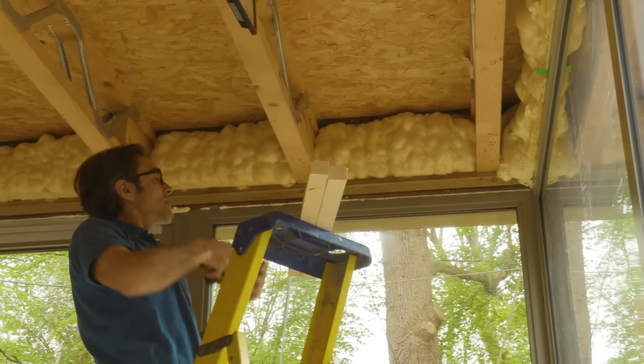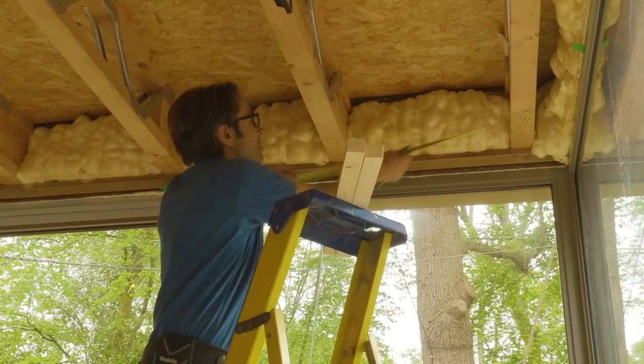With this system, I'm going to take all of that nice warm air, send it back to the unit, recover the heat, mix it with clean fresh air, and distribute it to all of the habitable rooms — providing a much nicer environment to live in. It reduces dust and all the things associated with allergies as well; there are allergy filters built in. So it's just perfect for modern living.